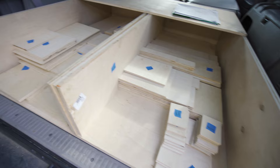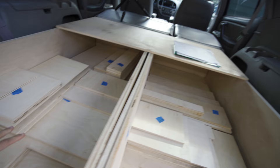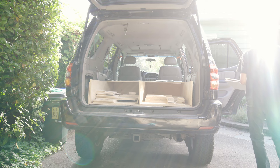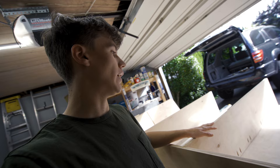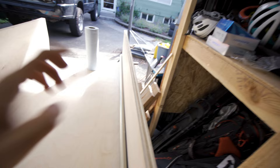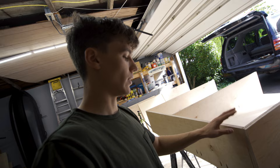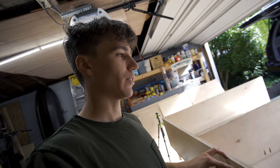I did label all of the pieces when I was making the plans — this will just help me keep track of all of these different pieces. Some of them are really similar in size but just slightly different, so this is kind of my way of keeping everything organized, at least trying to, just to make it easier when I start assembling everything. This is the biggest thing I'm still a little bit worried about — since I am using the drawer sliders, I know everything should ideally be pretty straight for that. You can see the front of the drawer slider right there is flush and it goes straight all the way back for the most part. But right here at the end there is just a slight gap — the way I built this, it is accidentally 1/16th of an inch wider in the back, so it is not perfectly straight. I am hoping I can just push the slider in, get it to sit flush, and it will work fine.